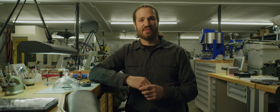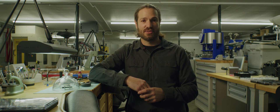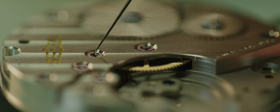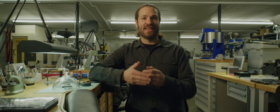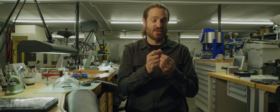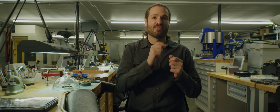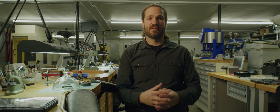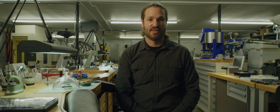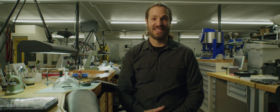There are other loupes that have higher magnification. When we get into fine little details like oiling the escapement of a watch, this requires a ten times loupe. It puts the watchmaker's face right up against the watch movement, but it allows us to accurately move an oiler with a tiny little drop of very special lubricant for the pallet fork stones and place it right where we want it, so that it doesn't wick away from where it's supposed to be.